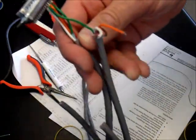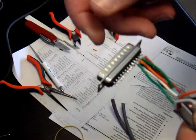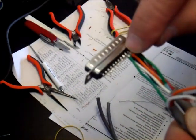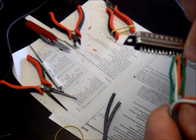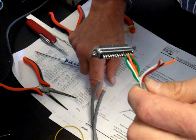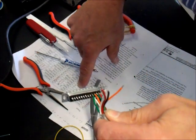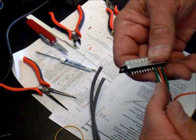On the other end, we're hooking them up to the appropriate pins. There's a certain amount of bookkeeping involved here — keep the right pin number and the right thing. So the next pin I'm going to do is pin 1, 2, 3, 4, 5, which is minus 12 volts, which is the black wire. So the black wire will go into the next one.